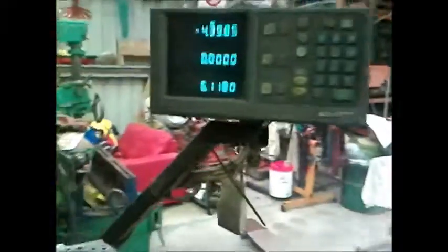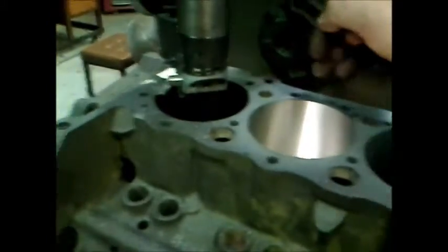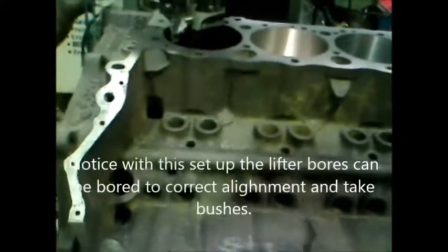That does shift the bore spaces, and what I like to do — the reason I like to use this setup — is because using the DRO, I can put the bores anywhere I want. I can keep them dead square straight up off the tunnel and keep them on their bore centres. If I've sonic tested the block and with the cut I'm about to do I'm not going to end up with enough thickness on the thrust side, I could move it away from the thrust side a little bit. There's a lot of scope for putting the bore where you need it to be, not just relying on your cat's paws.